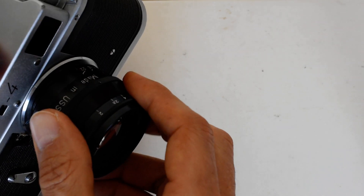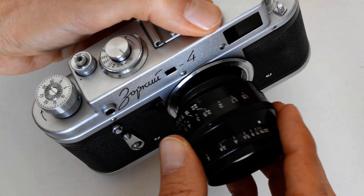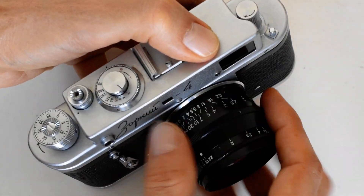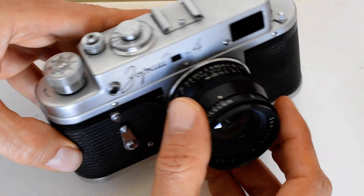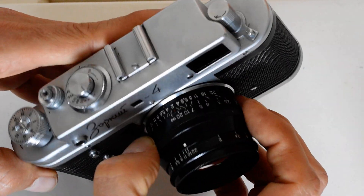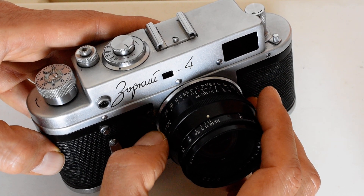There are some compatibility issues between Soviet M39 lenses and Japanese M39 lenses. Most will interchange, but watch out for telephoto lenses — those are the ones that don't really interchange all that easily. There's a reason bayonet mounting caught on: not because screw mounting was insecure, but because if you don't align it properly and try to force it, you can strip the threads and damage both the camera and the lens. I've been using these things for years and still find it a little fumbly sometimes to get the lens started when screwing it on.